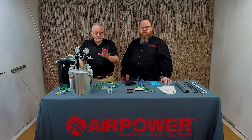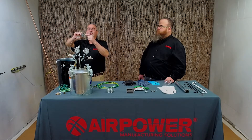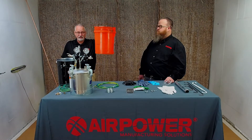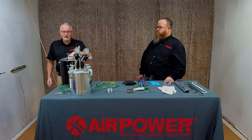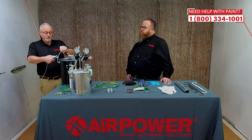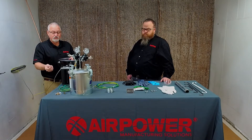As a rule, we're talking about solvent-based coatings here, so keep that in mind — not necessarily water-based for the moment. This is a great grounding clamp with sharp points and a lot of tension from a spring. You cannot use a plastic bucket and expect it to be groundable. It is not — don't use them in your finishing operation. Only use a metal bucket. If you use a liner, make sure it is static dissipating. Most white ones are not; the pink ones always are. Ground it to the bail or the handle. If you're spraying out of a pressure pot, ground your pressure pot. If you're spraying from a pump, ground the pump. You've got to ground those sources.